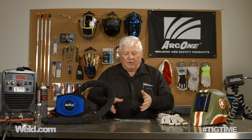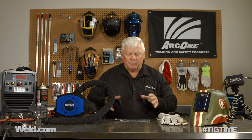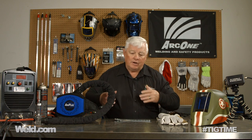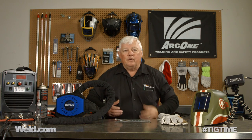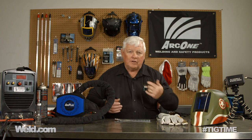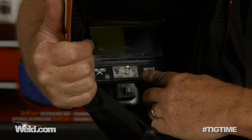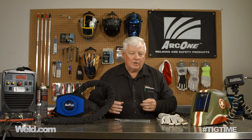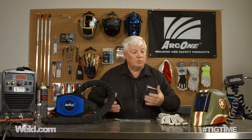Okay, now that I've finished doing a weld here — I've only got about a three or four inch weld — but you could see that there was smoke coming up. And there are some things that are pretty bad for your lungs that you can't see. I'd never used one of these types of helmets before. I'd always gotten into a well-ventilated area, located fans in certain areas, and I often wonder how much damage I've caused myself. I was curious about this welding helmet — it goes from a shade five to a shade fourteen. I was welding at about a shade ten, but I'm wondering: I get into situations where I've got everything from dust to oils in the air — if I could have continued to use this helmet just as a respirator.